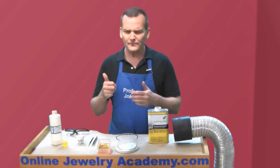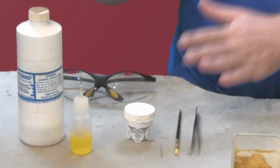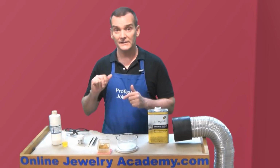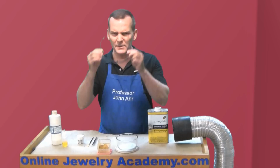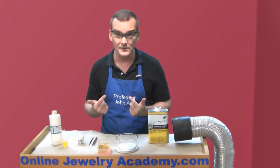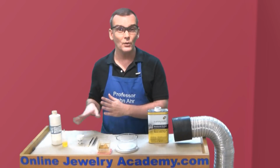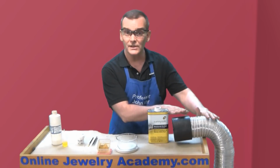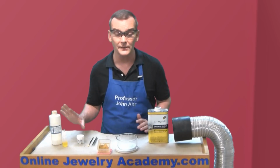Okay, now, what do they both have in common in terms of their formulation? They both contain boric acid. Now, another thing that you need to know is that they both have other safety considerations in common. Number one, you always want to wear eye protection whenever you're soldering. You don't want the flux or anything for that matter to pop into your eye or eyes. And the other thing is that they both give off some toxic fumes or noxious fumes. So you need to be working with good ventilation, no matter what type of flux that you're working with.